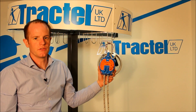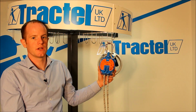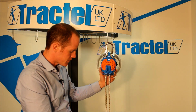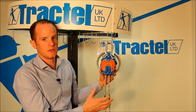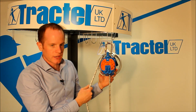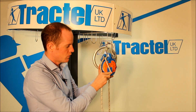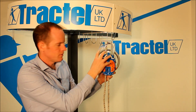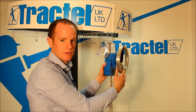Here we have the D-Rope UP-A device. Unlike the standard version which is for descent only, the UP-A can be used to descend but also to raise the casualty back up towards the anchor point. The front part of the device is exactly the same as the standard — two ropes coming down, controlled rate descent between 0.5 and 2 metres per second. As with the standard, you can slow the rate of descent using the rope guide and S-bend to add friction, or lock it off altogether at the front. It is EN341 rated for the device and also has the addition of EN1496, which is the rescue recovery winch on the rear of the device.